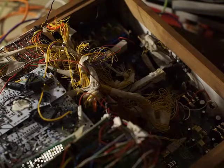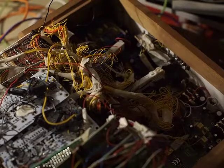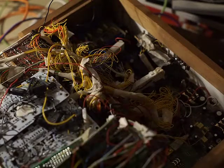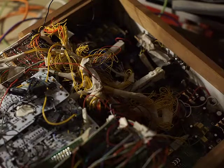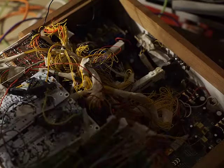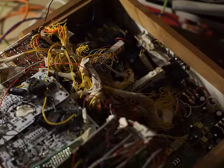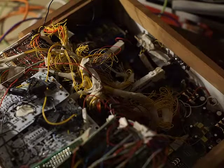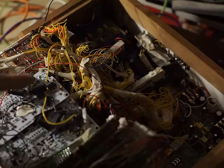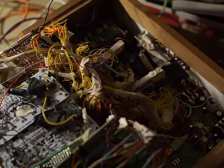And we basically did all the connections on the board, and then we took the output from each summed channel, mono and stereo, and we fed it to the 2nd rack mixer with a small Kynar wire. Because we doubled the power, we also had to swap some capacitors up to 25 volts. One for the aux input of this chained rack mixer, and also the main outputs have been swapped from 16 volt to 25, while all the other capacitors can stay at 16 volts, and it's okay.